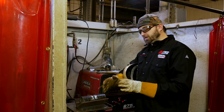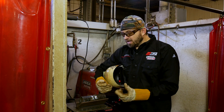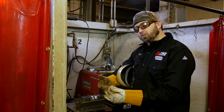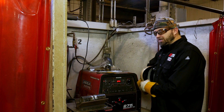So let's talk a little bit about it. I've got my two-inch setup in my tacking tray here, and that's going to help me line my pipe up the proper way. I'm going to make sure I've got a nice one-eighth inch gap, so I can get the wire to go in there the proper way. I've got my machine set up on DC negative, going to run around 90 on putting in the root.